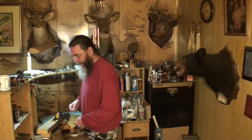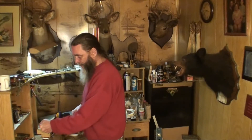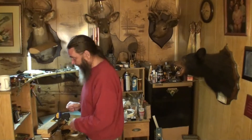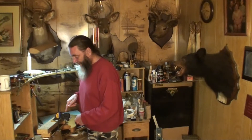I'll show you how I got it clamped up here. I come in here every day, one time a day, and tweak that adjusting head bolt on the truss rod — about an eighth of a turn each day. The truss rod is quite a bit tighter now than it already was. It was already tight as hell if you all remember. Well, it's really tight now.